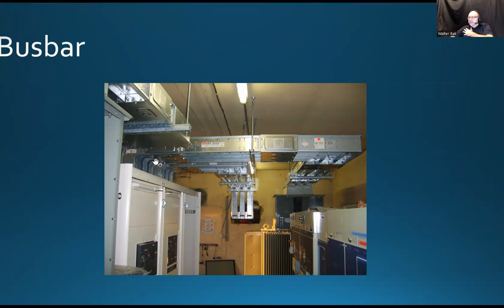Now, they're also quite popular in the office furniture, so-called modular office furniture, also known as the cubicles. Quite often on the bottom of the cubicles, you will have a bus bar included, and some of them are built into the cubicle or the modular furniture. So it's basically snap and lock, and that's how your wiring is being run. That's mostly for electrical systems, and you still have to run the data part because nobody knows how many outlets there will be and where they're going to be. So that's a bus bar.